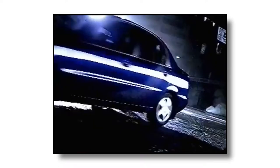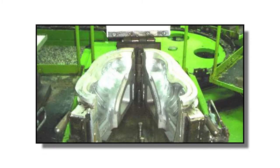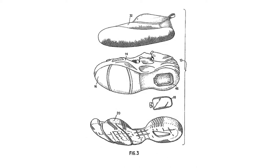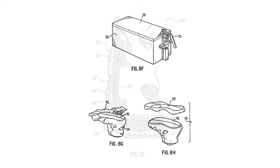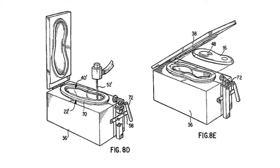While a surprise for most people, Daewoo actually managed to create what Avar had envisioned, but the results didn't come easy or cheap. To create the mold, Daewoo poured polyurethane liquid into the mold and then heated it up to between 130 and 175 degrees Fahrenheit. After the upper was constructed, the midsole itself needed to be revamped — made about five times stronger than any traditional midsole, which utilized gluing and stitching. All of this reportedly cost Nike $750,000 for the mold alone.